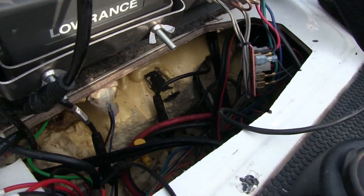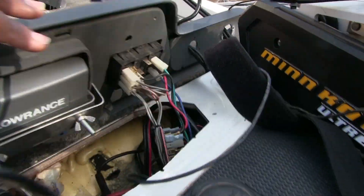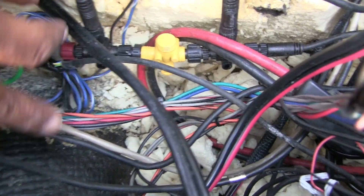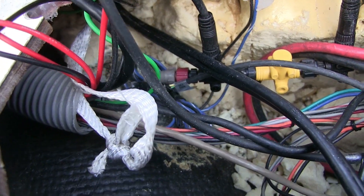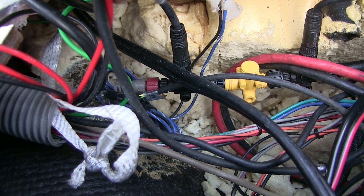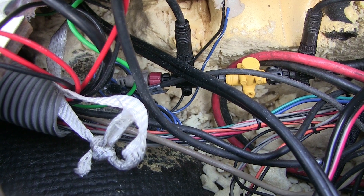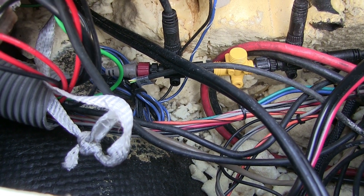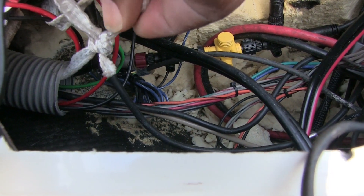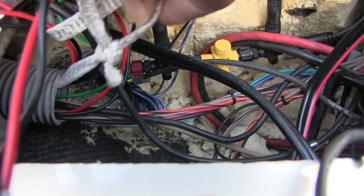I want to show you here in the front where I've got everything and why I've got it labeled. You can see all these cables come out of this conduit — this is the conduit that runs to the back where all the cables come from. It's probably only a one-inch conduit, so you only have that amount of space in there. I'm going to pull the old power cables out before I run new ones. I already got a pull string in here from running it last time — I'm going to show you how I'm going to hook that up. That's the key to running cable in your boat: this pull string.